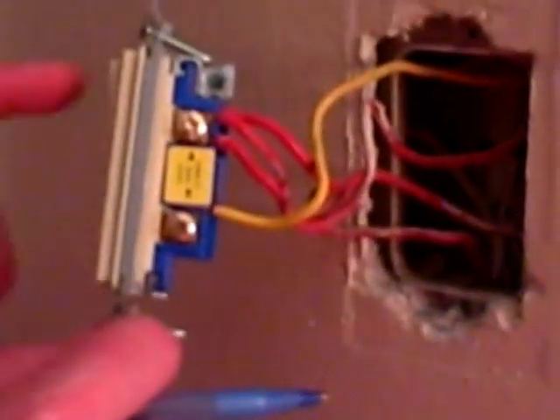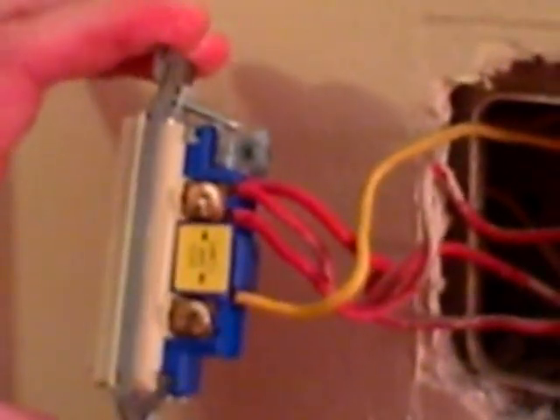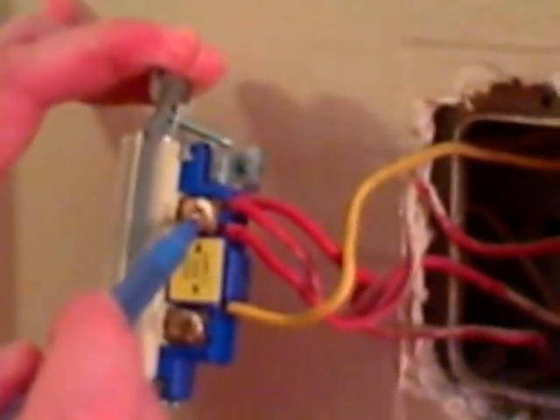I'll open a couple other boxes to give you an idea of what you might run into. This is again a single pole switch, but it's going not only to an overhead light but also to two switched outlets. This is a very unusual switch because instead of having a screw terminal that you wrap a wire around, it actually goes under a little clamp. Once you screw down the screw, the clamp pushes against the wires — you've got two wires under two sides of the clamp, and a third wire going into a push-in terminal on the back. So you've got your hot coming from the service panel connecting to all three of these, being turned on and off by the single pole switch.